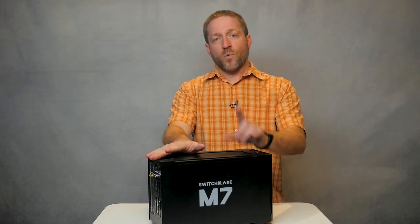You plug them right into the M7 for both power and video. One Ethernet cable using NDI is your input to the Switchblade. It's also audio, it's pan-tilt-and-zoom control, it's tally, it's comms, and because of Power over Ethernet, you're powering that device from the M7 — all with one wire.